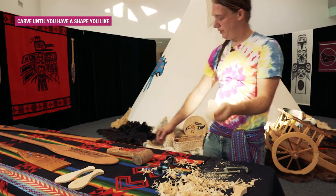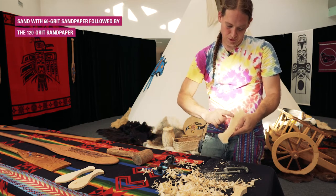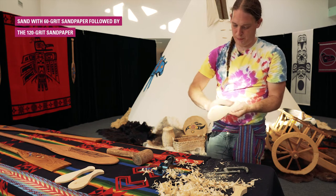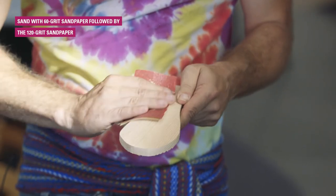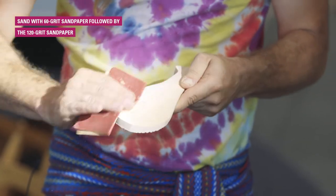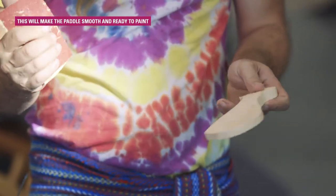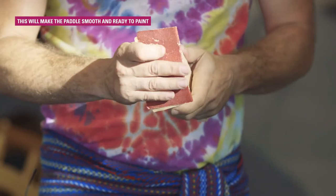Now what you want to do is take a piece of rough sandpaper and start sanding over the edge and around the outside, because that's where it'll be sharp. Take your rough sandpaper first — I like to use a 60 grit for the first pass, and then like a 120 for the next one, a nice piece of smooth finishing paper. Paddles don't have to be perfect, so I just draw it out freehand and let it be what it wants to be.